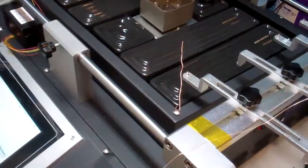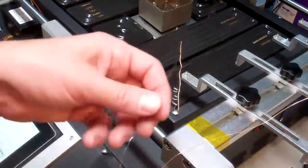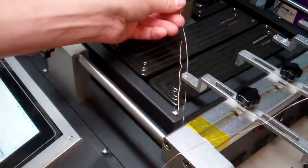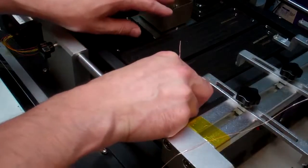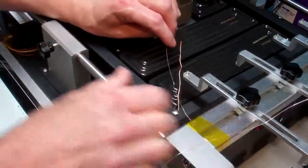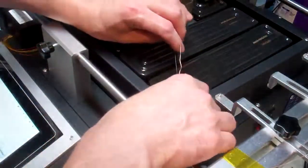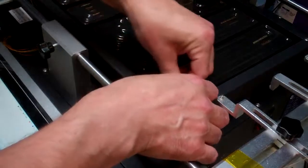On your right side you have another probe — this is where our lower heat monitor comes in. It's important to know the bottom heat temperature actually being applied to your board. Taking your stainless steel encased probe, go ahead and mount that in the lower airstream, then repeat the same process we did on the other side. This one's going to be a little bit trickier because it won't give as easily. We're going to loosen this up and get a little more room, set our length, and then take our probes and twist them together.